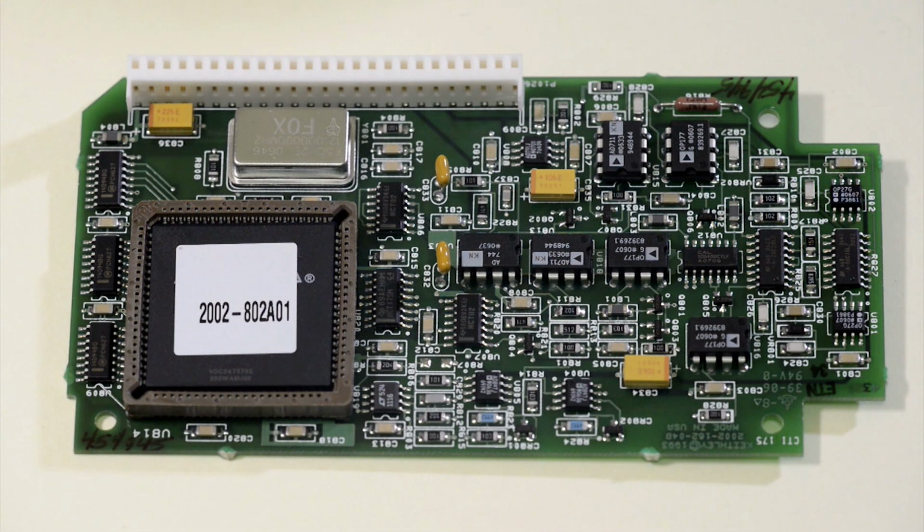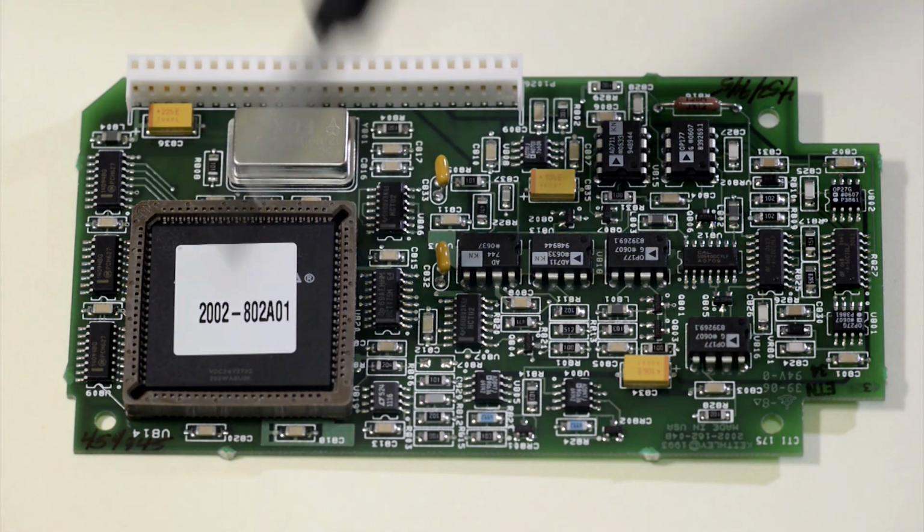And this is the ADC board. It's made by Keithley, and here is the code 2002-16204 revision B. It was developed in 1993 according to the date, and of course made in USA like all the high precision Keithley stuff. Here we have the control CPLD, which actually connects both worlds together, the digital world and all the switching, communicating and converting the analog data from the comparators to digital form, which can be translated later for the CPU.